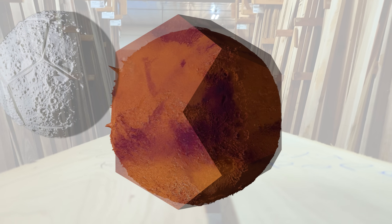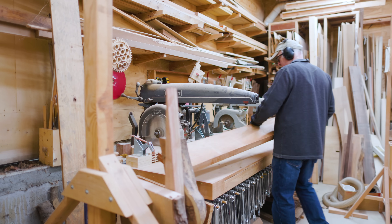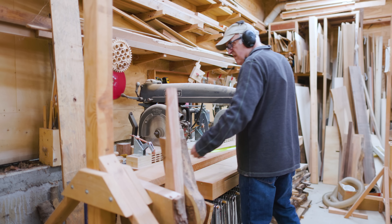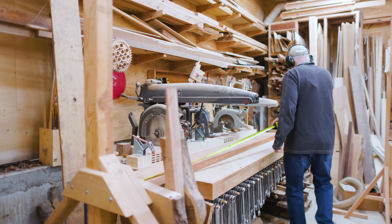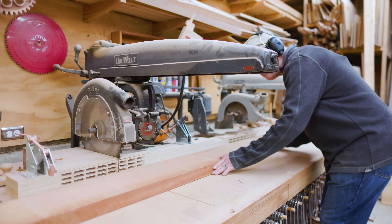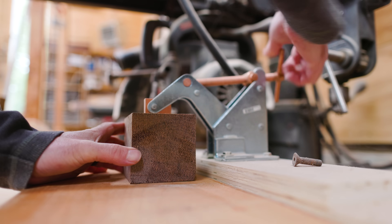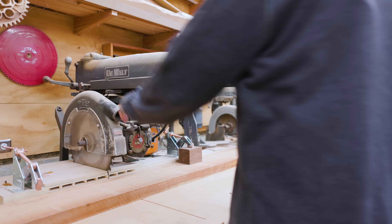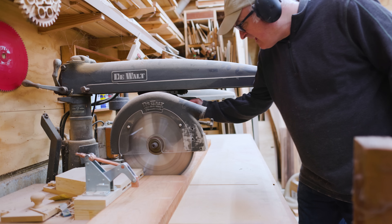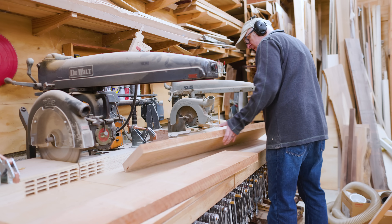With the moon project I used poplar, but I thought I should use something a little darker and a little redder. I found a nice piece of cherry. I can cut that piece in half, as I'm going to cut this into small pentagons in the end, so I don't need any long pieces. It's easier to plane and joint if it's cut in half — there's not as much cupping and twisting of the wood when it's shorter.